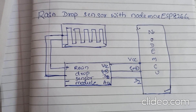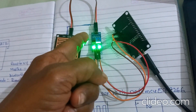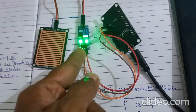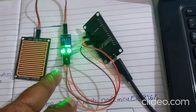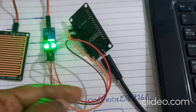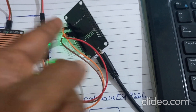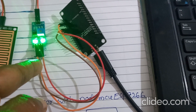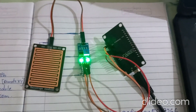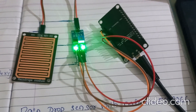That's about the circuit diagram. Here I am using a raindrop sensor. The two sensor pads are connected — the plus is connected to the first pin and the negative is connected to the second pin, and it has four pins: A0, D0, VCC, and ground. VCC of the raindrop sensor is connected to VCC of NodeMCU, ground to ground, and here I am using the digital pin, connected to D2 pin of NodeMCU. After downloading the program, I will show you the result in the serial monitor.